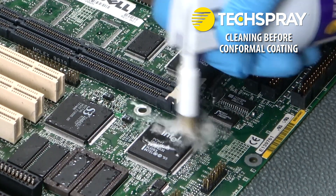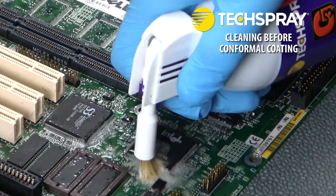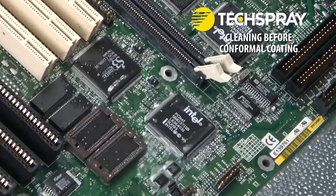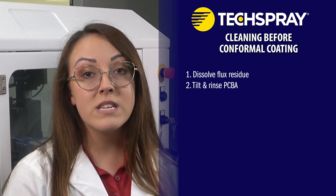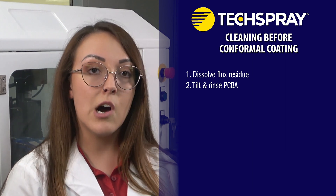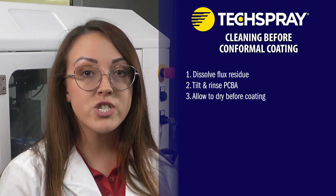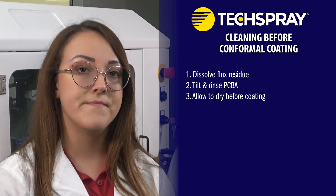I'll focus on aerosol cleaning because that's the most practical if you're setting up a new cleaning operation. All defluxing processes basically involve dissolving the flux residue — choose a cleaner that works best with your flux. A good match will reduce the need for extra soak time and agitation. When flux has been sitting for a long period of time or has been baked on at a high temperature or long reflow cycle, additional brushing may be required. Flushing or rinsing off the dissolved residues is essential — remember, once flux residues are dissolved, they won't just evaporate off; they need a chance to flow off the circuit board. Holding the board at an angle while cleaning can help. A final rinse is always a good idea and required if you are using a water-based cleaner. For fast-drying solvents, drying isn't usually an issue. For water-based cleaners, you can accelerate drying with a duster or use alcohol as a drying agent. Once the PCBA is clean and dry, it is ready for the coating process.